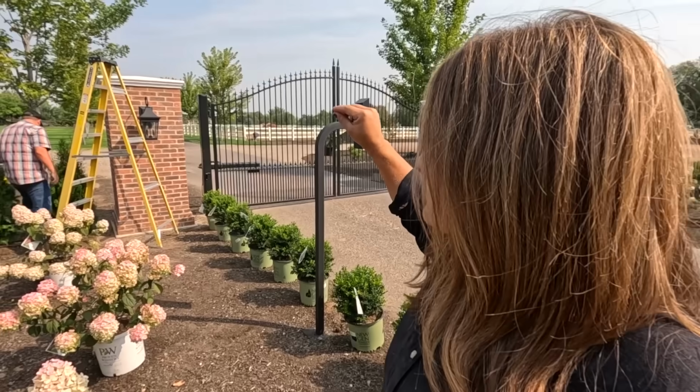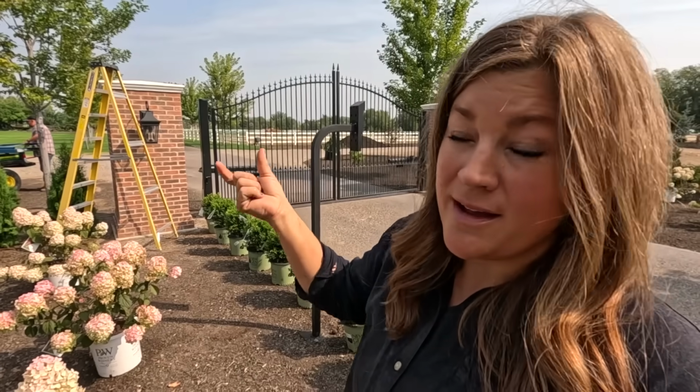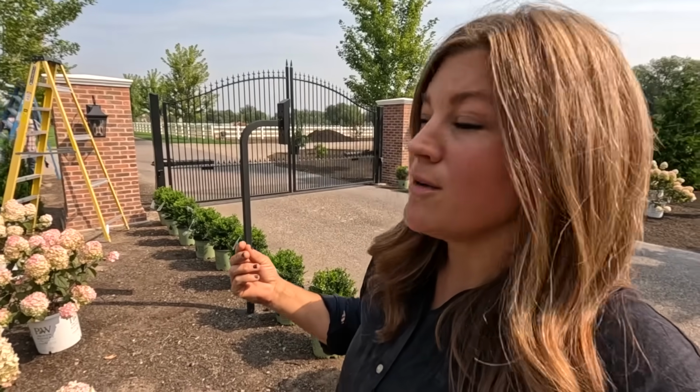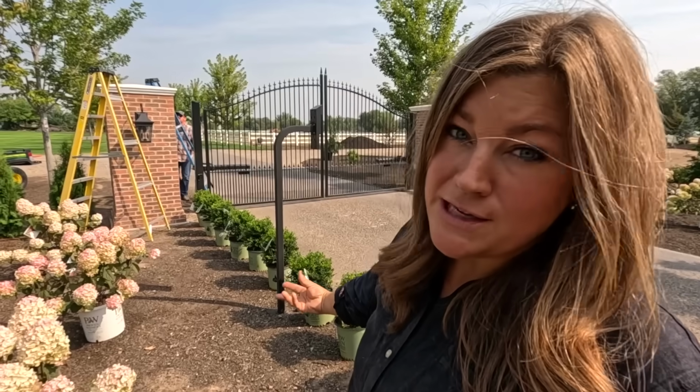And the reason why we had to go with foam is because we made our pillars just a little bit, like 3-4 inches too big for a regular size pier cap. So we were getting into custom territory, which was in the high teens of thousands of dollars to get them, and they weighed a ton, like a tremendous amount. We would have had to have engineered plans for our pillars and a bigger, deeper foundation than we do.